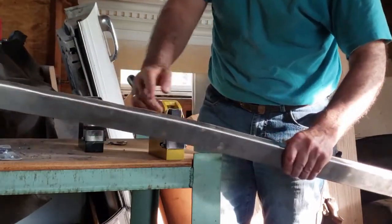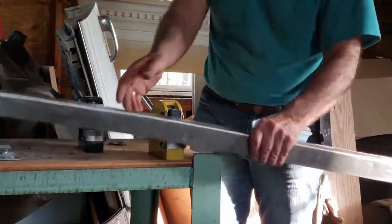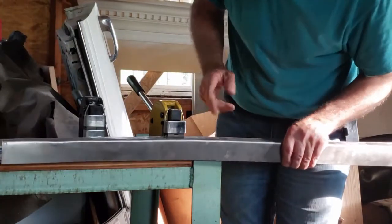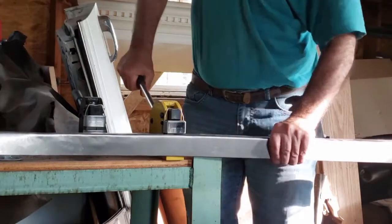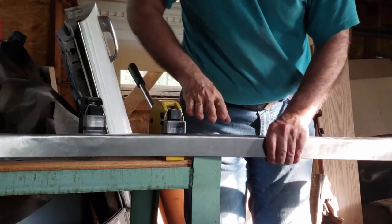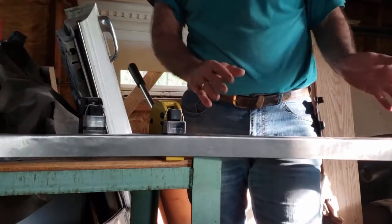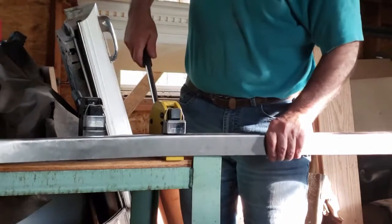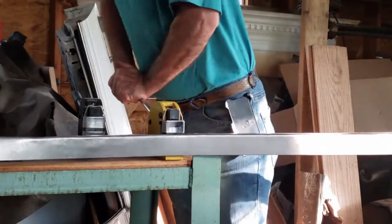See that nice little bend — I'm going to cut it here because I hammered this section. This piece is going to be on the bottom half and this piece on the upper half. I want to stretch it a little more and then cut it. You could use a marker and put half-inch lines on here, but this doesn't have to be perfectly accurate since it's behind the quarter panel and no one really sees it. Every half inch or so, put it in, tighten it, and use two hands to push down.